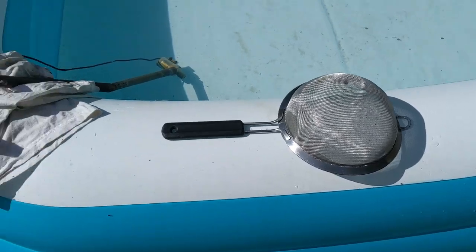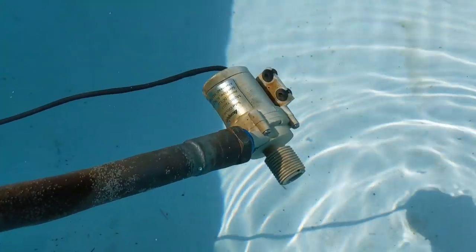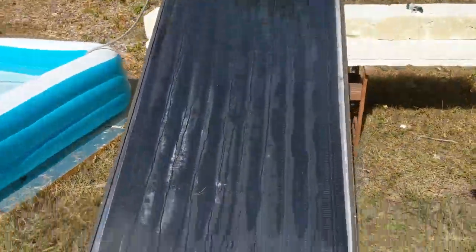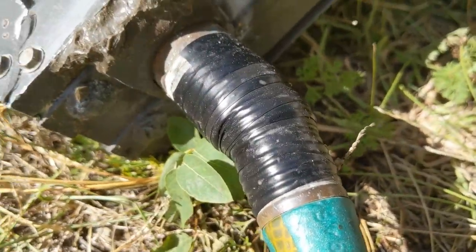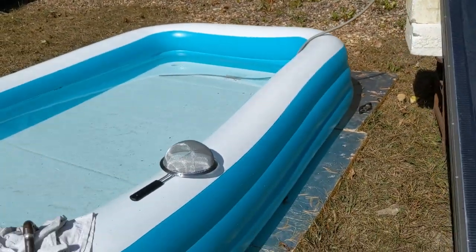Don't tell my wife. Here's the little 12 volt pump — this is the same pump that I used when I ran an experiment earlier. Here is the flat plate solar collector and I didn't even bother soldering on any fittings. Everything is just electric tape put on there, but if you do enough wraps it pretty much doesn't leak because there's no pressure in the system.